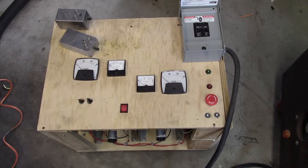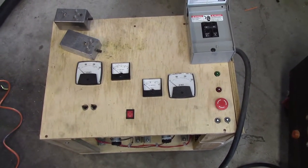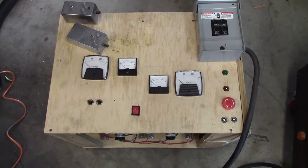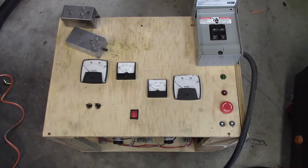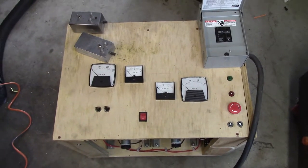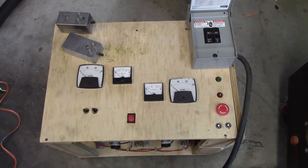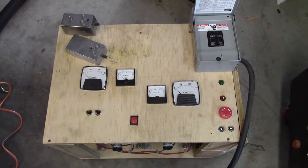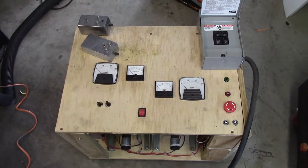I haven't spent any time talking about how I get power to the large Tesla coils. I do not use a neon sign transformer for those. Generally the progression of coiling mania is: you start with your spark gap coils, keep adding more neon sign transformers in parallel, doubling the current or adding 30 or 60 milliamps at a clip. Sparks get bigger and bigger but stop at a certain point and you realize you need more current. Then you might move from a 120-volt supply to a 240-volt supply. Some people use pole pigs — the type of transformers you see on a telephone pole — and I have one and have used it. The problem is there's no current limiting on a pole pig, so it views a Tesla coil as basically a short circuit. You need to find a way to throttle the current using various chokes.